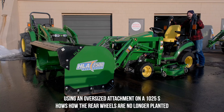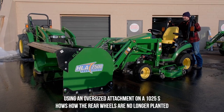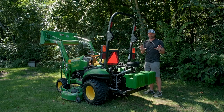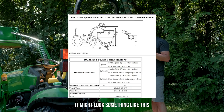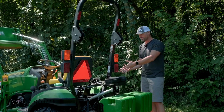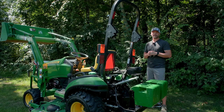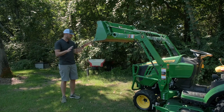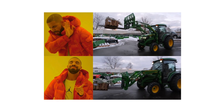When you have a bucket full of dirt or rock, when you start to pick that up and move it around, if you're really light on the back, you'll feel that immediately when you take it off the ground. As you raise higher and higher — if you're moving around with your loader up that high — you're going to start rocking and rolling all over the place. Look at your operator's manual; John Deere is really good about giving you minimum recommended amounts of ballast weight. You need weight on your three-point, and more weight up front via liquid ballast or wheel weights. The stock setup on these modern compact tractors simply isn't adequate when you want to use the front end loader. The only time you want your bucket that high is when you're essentially at a standstill dumping it out. Always keep it as low to the ground as possible.